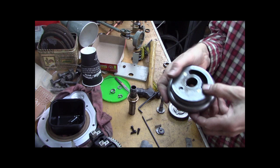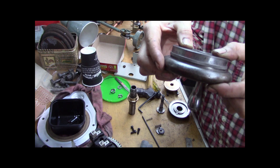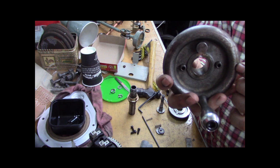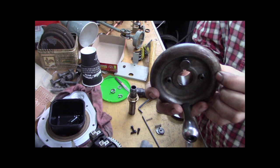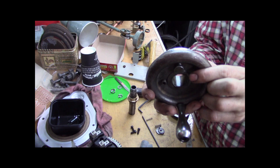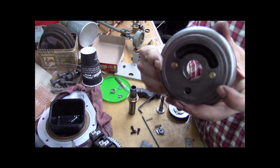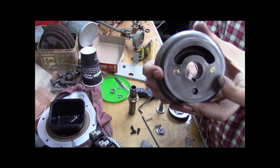This is the crank handle, right? And you know, you got your graduated ring here. Okay, so what the deal is, the Allen set screws, there's two of them, create friction, and the knurled nut there is the binder for the ring. On the backside of these Allen set screws, grub screws, whatever you would like to call them, there's these two brass wear pads, I guess, to create friction.